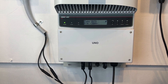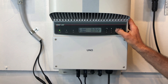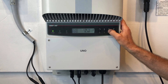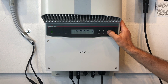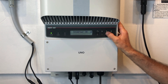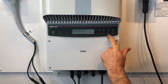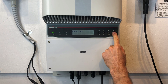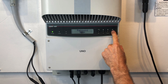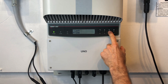The inverter has just started up again. We've got the green power light on and if we scroll through — it's still showing clock fail. What we need to do is actually reset the clock now. So we press the escape button and go to the menu system, then go to settings. Scroll down, press the down button and when it gets to settings press enter. The generic password code is 0000, so just press enter, enter, enter, enter, and then go down to time.